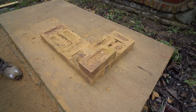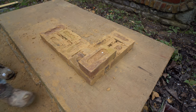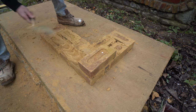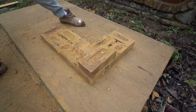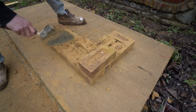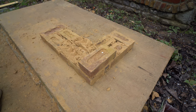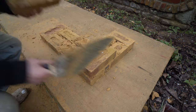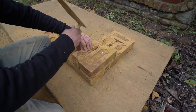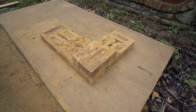There's your header. Now we get another queen closer and plunk that on this side this time — that gives us the correct bond again. Good old queen closers, very handy. Without these, nine-inch brickwork would have a hell of a lot more straight joints. So we plunk this in like so, give it a tap — don't tap it too much or you get water out of it. Then we put a stretcher straight in there to get that bond going nicely.